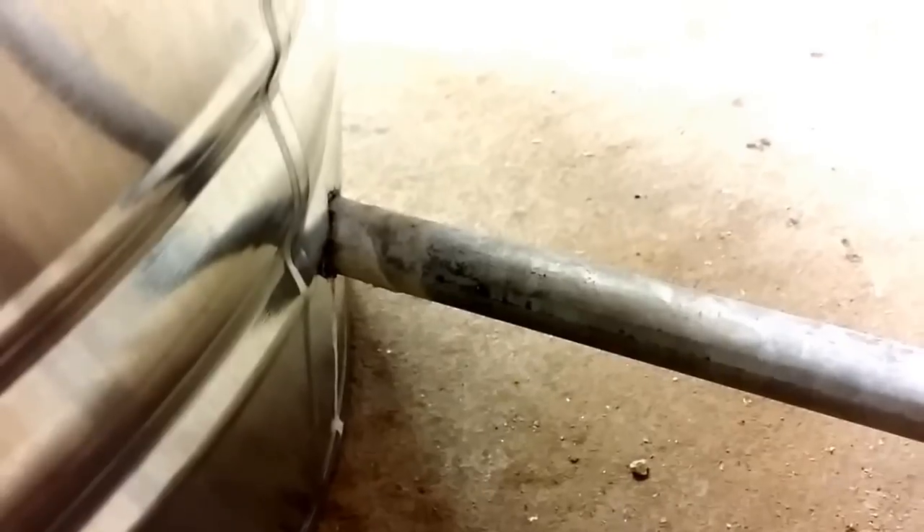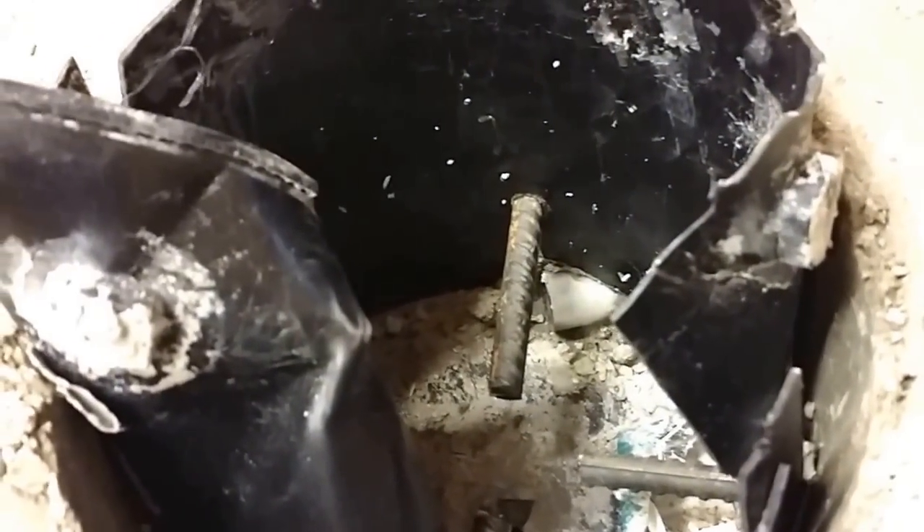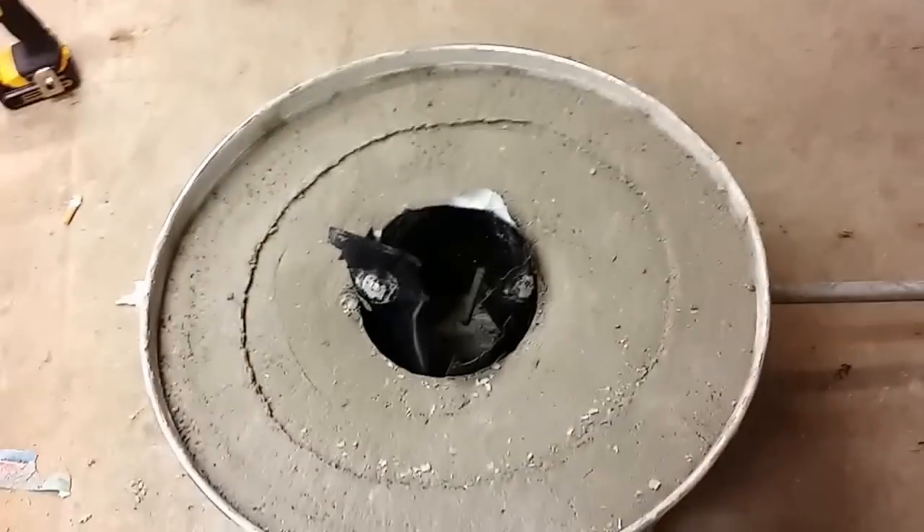There's a pipe that goes into the bottom for air. Over on the side, I cut a hole that has to be cast into the refractory mold. I put a really long pipe in there — I'll grab channel locks and twist it free. We want that to be removable because eventually I want to replace it with a propane burner. Right now it's just going to be coal or charcoal — regular large chunk charcoal or even briquettes will work.